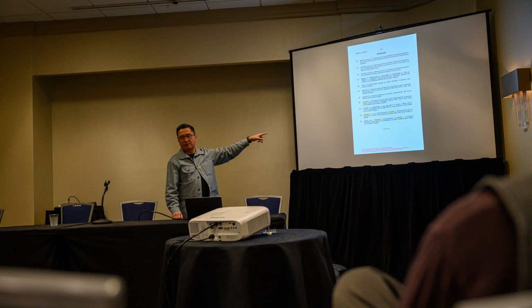Zwislocki designed his 4-branch coupler based on impedance measurements of 22 subjects using a special acoustic bridge inserted in the ear canal. This allowed measurements up to about 5 kilohertz for resistance and 7 kilohertz for reactance, which was fine at the time. Again, a lot of at the time it was hearing aids. Ear canal dimensions were obtained from 7 subjects and approximated to a cylinder.